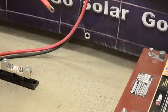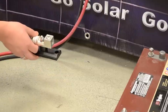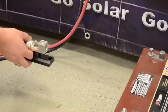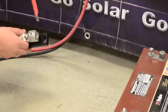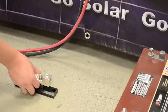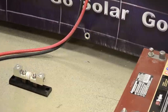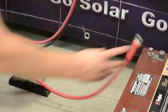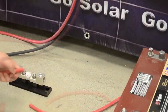Now we're going to go down to the battery, starting with the positive connection. Before we do that, we need to select our location for the inverter fuse — we want to have that fuse within two feet of the battery positive. We're going to cut this wire to go inside the two sides of the fuse. I encourage putting the screws in before you put the cable in, because once the cable is in it's very hard to put those screws in. Now I'll cut the positive wire and make our connections, marking my cut and then using the wire cutter.